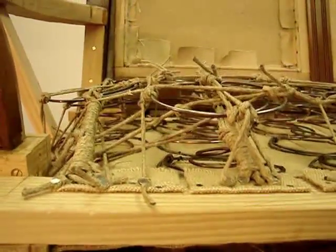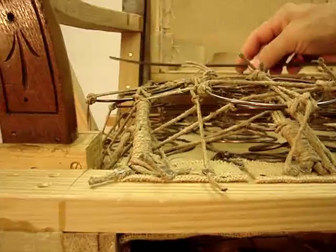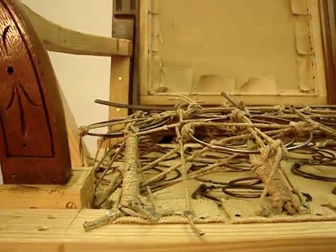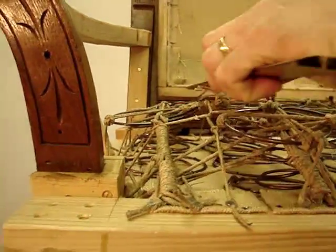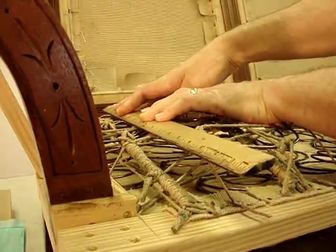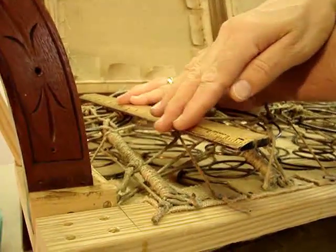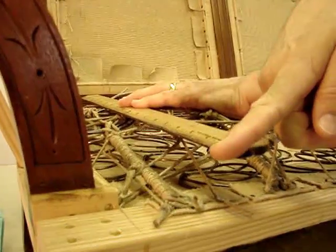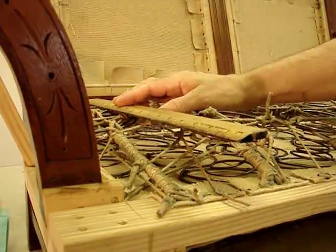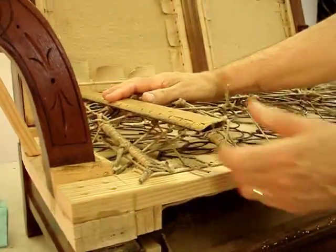You'll be able to see the elevation out here where the spring is omitted. Once the pod and edge roll goes in, you'll actually be able to see how it fills. Let me bring a straight edge over — a short one in order to be able to see it. The pod, which is filled with straw linen, comes over the top of the springs and out to the front edge and drops straight down to the front edge. All of this will fill with fiber, and the fiber will be contained in burlap so it doesn't drop down inside the springs — otherwise the springs would shred everything.